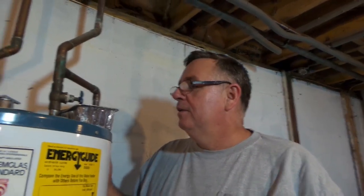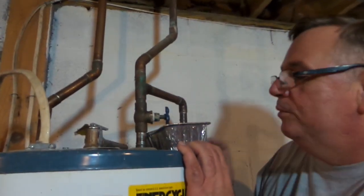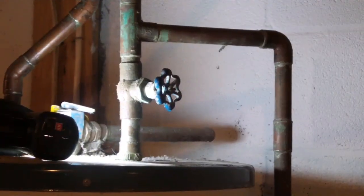So there you have it. All we did was replace — put the little rope there behind the packing nut — and now our leak is gone. So if you need to fix a leaking shutoff valve, that's basically all there is to it. Once you get the thing off, it's easy.